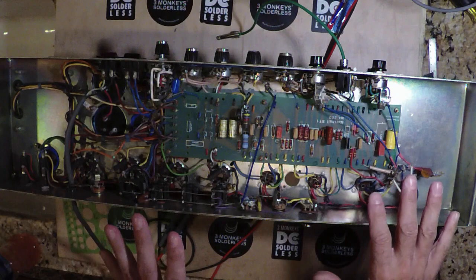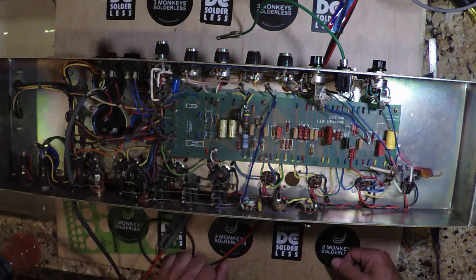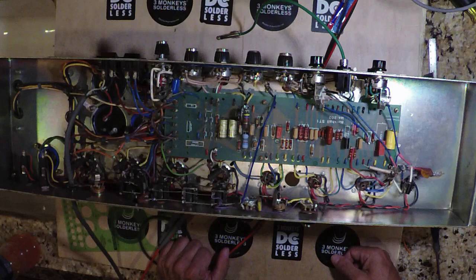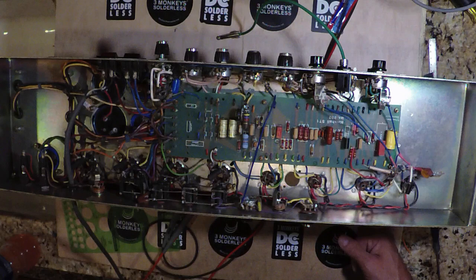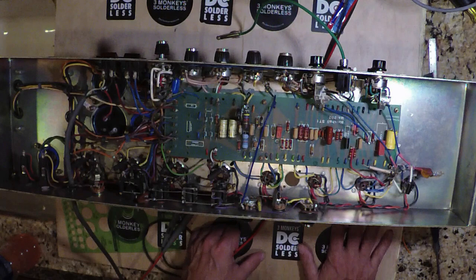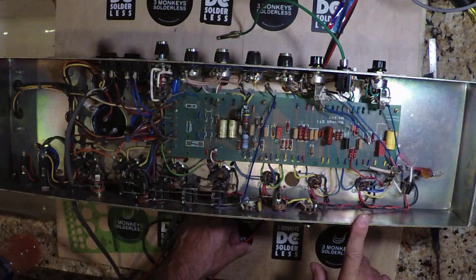If you don't know a lot about amplifiers, please don't mess with these things — especially when you're dealing with amplifiers with filter capacitors like this. They'll store enough current to melt your fillings and weld your zipper shut. If you get hit by this amplifier it's not going to be good. I've been electrocuted a few times but never with current passing through my heart — and it's not fun. Please do not start messing around with this stuff if you don't know how to work safely around high voltage and don't know your way around one of these amplifiers, because it will bite you. Thanks for watching — check out some of the other videos, and in the next one maybe we'll put some tubes in this, bias it up, and play through the aux box to see how it sounds. Thanks again.